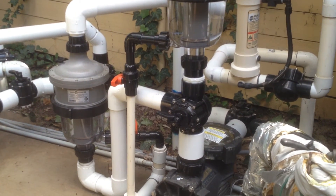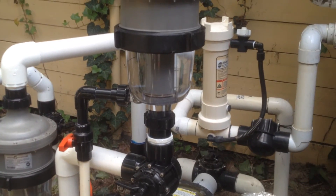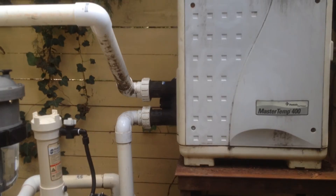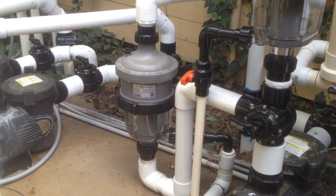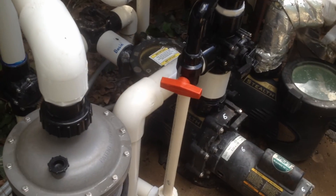We're probably moving right at 200 gallons a minute — probably somewhere around 70 or 80 through the vertical one, because I've got some back pressure off that heater. Then through the other, probably near 135, which is what these things are rated for. I'll shoot one video here coming up of it actually operating.